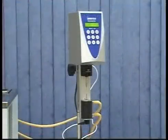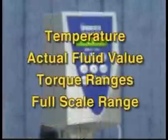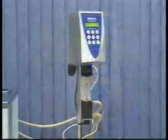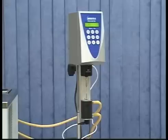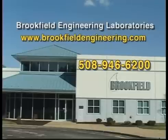You have performed a calibration check. Remember the important aspects: temperature, actual fluid value, torque ranges, and full-scale range. If you find the instrument is not within tolerance after performing a calibration check, repeat the calibration test to ensure everything was done correctly. If your instrument is still not within tolerance, contact Brookfield Engineering or an authorized dealer.